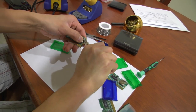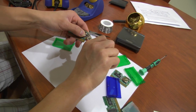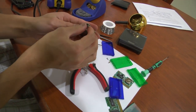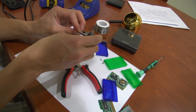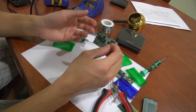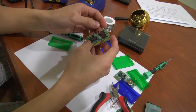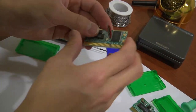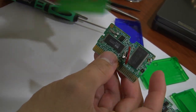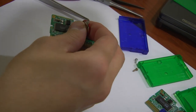With a little bit of twisting while maintaining control, we can just get rid of this tab right here. Got the tab off. Another reason I'm an advocate for cutting the tab on the battery is it also reduces the amount of heat I'm going to be transferring to the printed circuit board. That will actually reduce the chance of data loss or even damage to the components. Remember, these components we're dealing with are over nine years old — on some of them, maybe 10 years old.